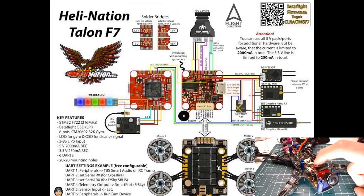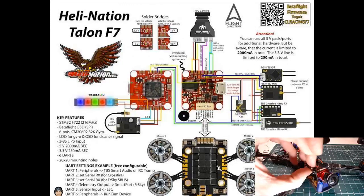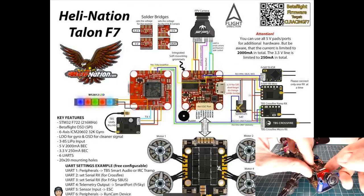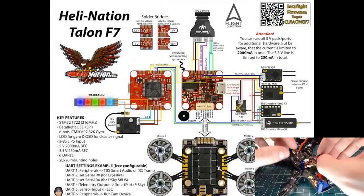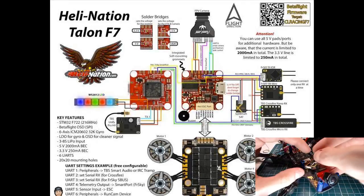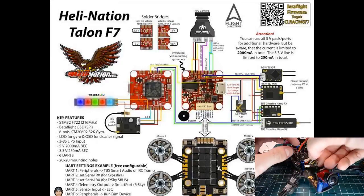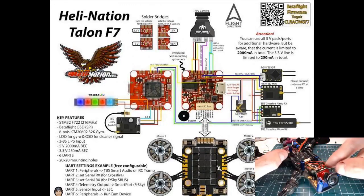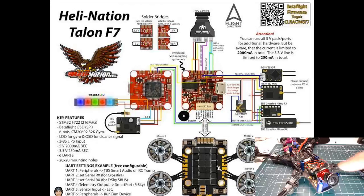Oh, because this is the flight controller that had the 5-volt regulator die. Interesting. Okay, so that's fine then. I guess I can look up the pads on the bottom too while I'm at it. So I'm actually going to end up depinning that. That's kind of funny. Okay, so on the opposite side here, let's figure out what these are, and we'll desolder them and swap them over, and all will be well.